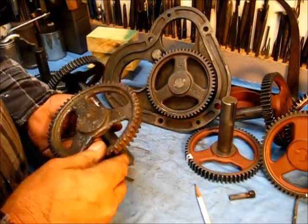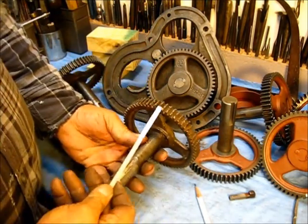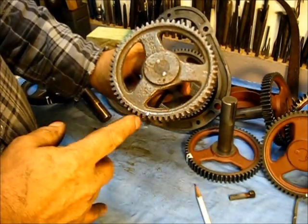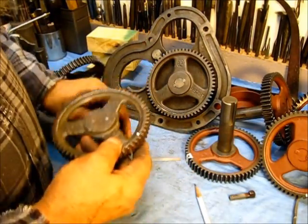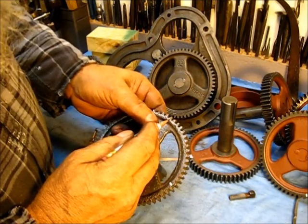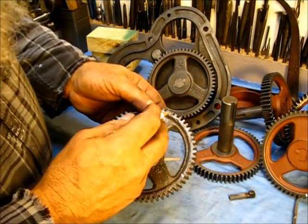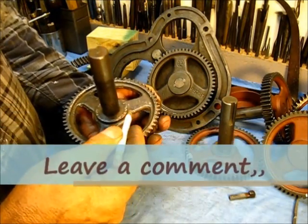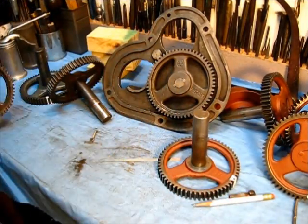What you would do is take a straight edge, put it in there, find the two teeth that line up with the keyway center — I've already got it marked. That's where it lines up, that center tooth. Then use that number, count 16 teeth around, and it comes out to that one right there. You can see a file mark on those two teeth. Over on the rusted side, you can't tell if the teeth were ever marked there — they're just nonexistent from the rust. But that's not to say they were not there to start with.